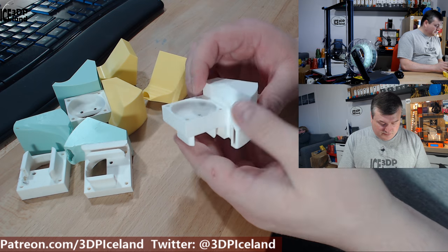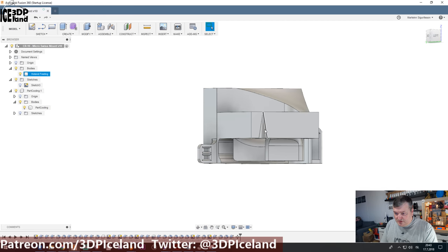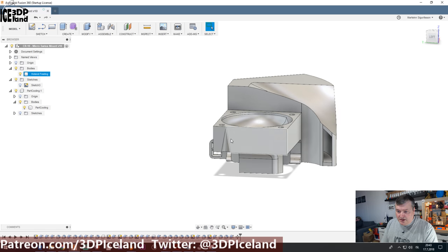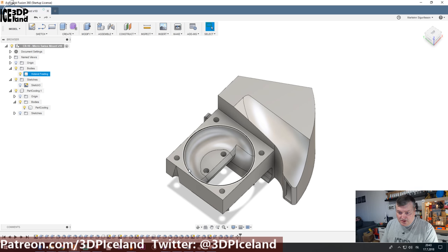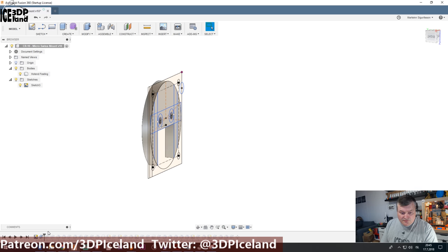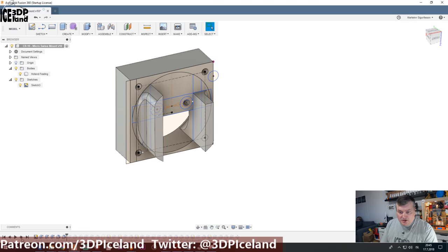Let's have a look into Fusion 360. Here's the part all done, and this part here was added before I printed those prototypes — this is to get your Allen key to the mount for the EZ ABL sensor. So let's look at the two parts. This is the initial sketch for the hotend mount, here's the hole for the fan and mounts, and several objects were extruded out of this sketch. Here I got the basic shape and added some chamfers.